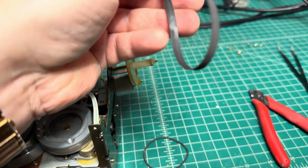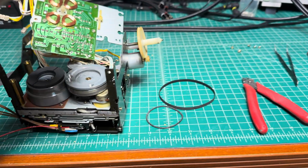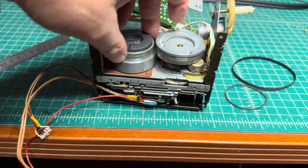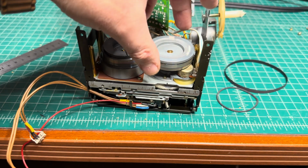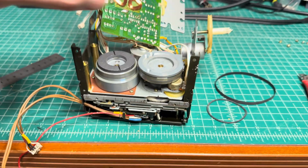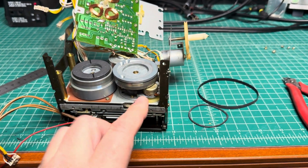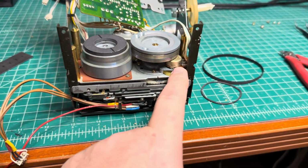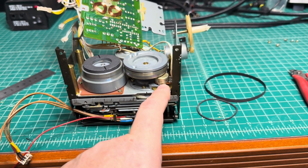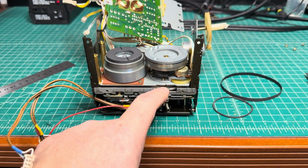All right, some lubricant there. Really good that they're not molded yet, so it would be easy to clean. Oh, capstans are dry. They're not rotating well. All right, so I will disassemble, clean up everything from the back, deoxidize this pot. That's a necessary condition to make sure it will give proper voltages to the CPU to understand the position. Add lubricant to this big command gear.